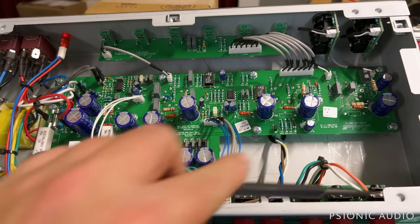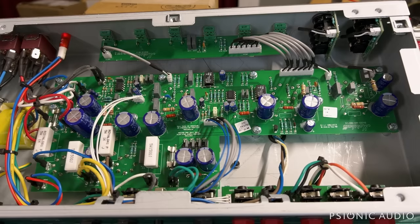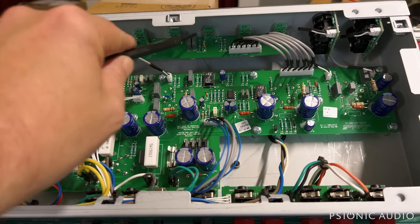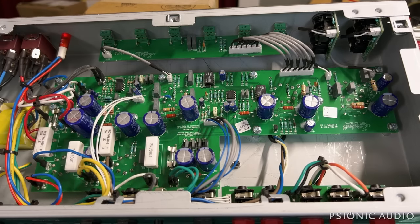I'm going to pull the rear speaker jacks to make sure they have not continued on the normaling mistakes from the JCM 900 and 2000 series. I don't think they probably would have, but one never knows. That's a big thing to look out for on these Marshalls. I'm really disappointed with these little pots that they use. This is essentially the same kind of pot you'd find in a Blues Junior, and I associate this with very inexpensive amplifiers, not $1,900 amplifiers.